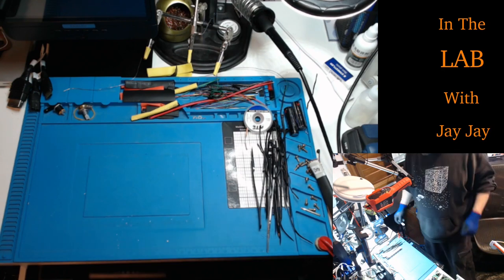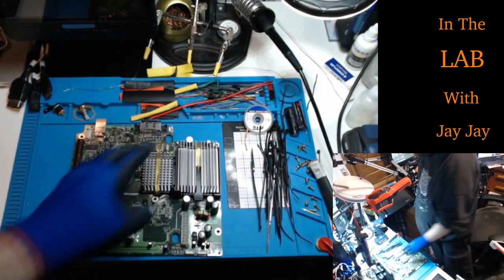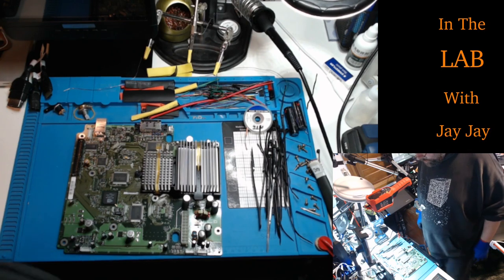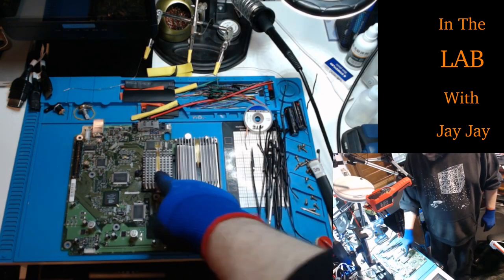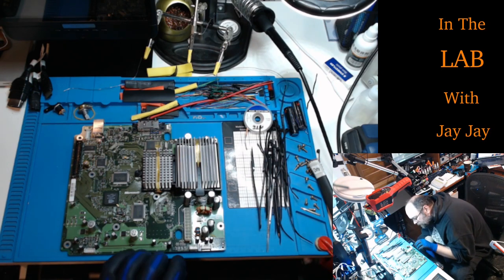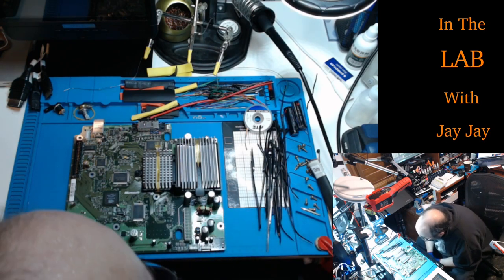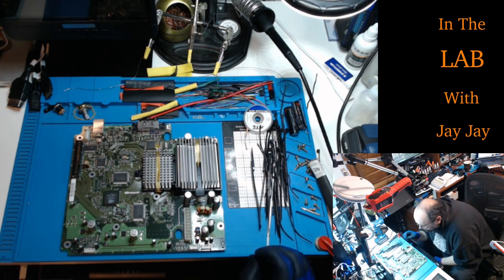Now, apart from the capacitors, we're just going to do the heat sinks as well. The heat sink and these caps. 1, 2, 3, 4, 5. The rest of the caps look like they're okay. So, paste, cap. 5 caps. I already said that, didn't I? I'll say it again. Now these are 330 microfarads at 6.3 volts. All of them are. And these two here and that one, they're all gone. These little guys look all right.